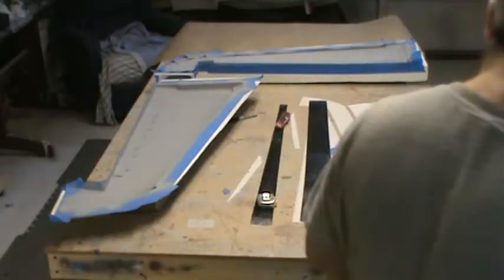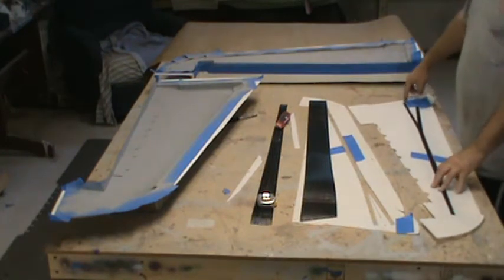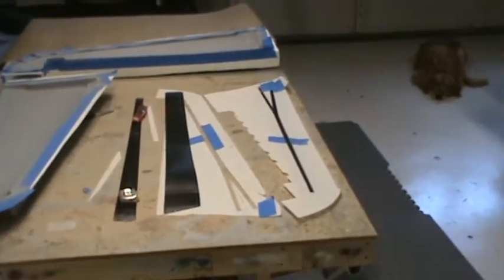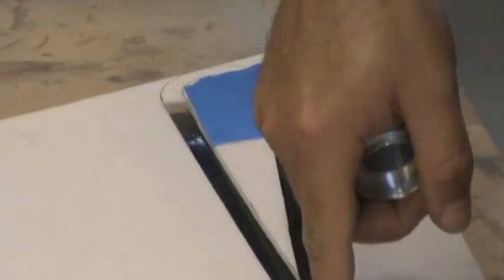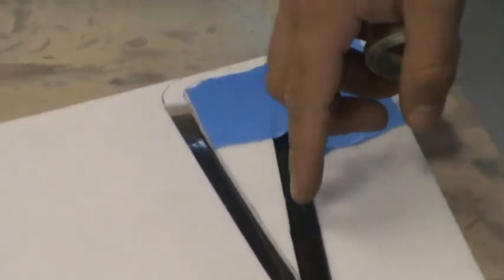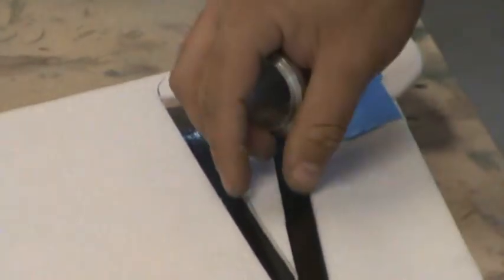So looking at the wing core here, we have the unidirectional carbon under it. Everywhere you see carbon coming through, including up here where you can't. Let me zoom in for you guys so you'll get a better understanding. Alright, there we go. Get the camera exactly where I want it. We'll be good to go. Everywhere you see this hole right through here in the wing core is going to get packed full of carbon fiber tow. And you're like, okay, great. So that'll end up being our spar cap there.